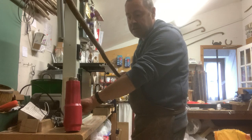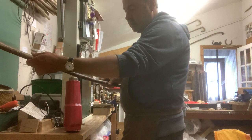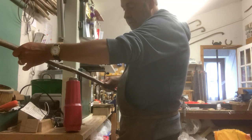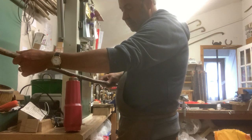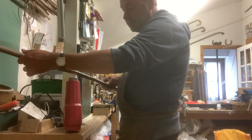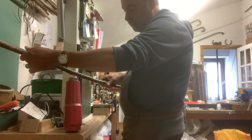There's my mark. I'm going to bend it the opposite way, so that bend turns that way. A few seconds in the heat. Keep it rotating so you don't burn it, and just keep it right above the heat zone — don't do it up high, it will take forever, get it right down here. About 10 to 15 seconds is all you need. If it's too much, you make it brittle instead of soft.